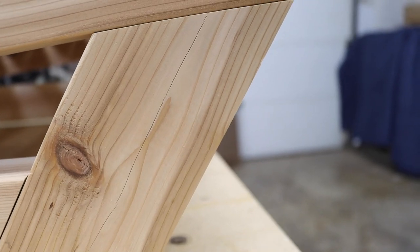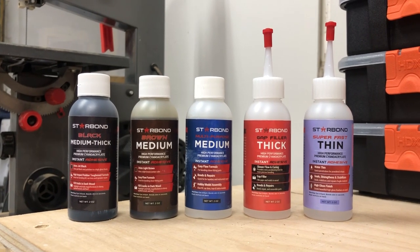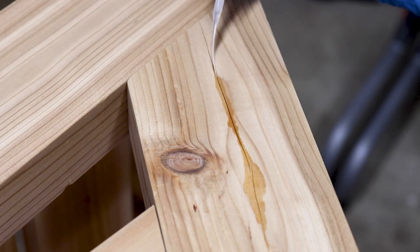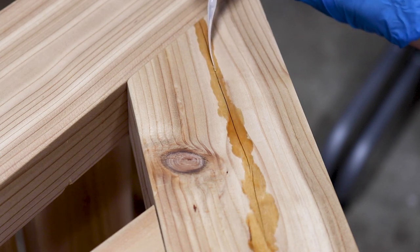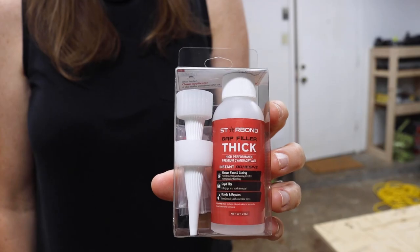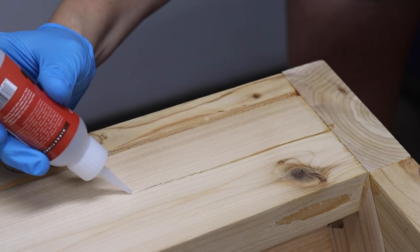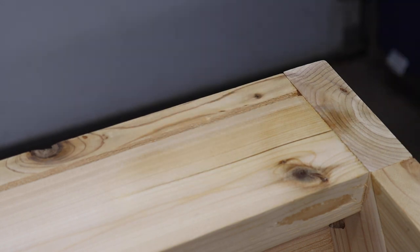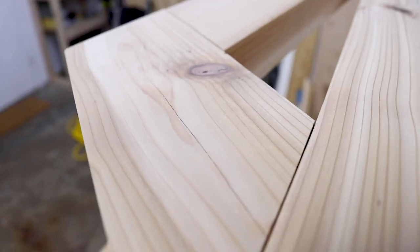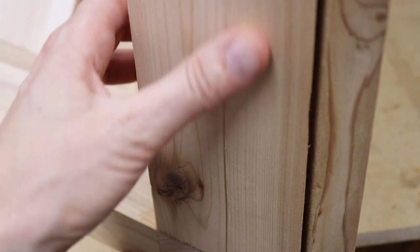There are a couple of small cracks in the wood that I want to stabilize so they don't crack further. I like to use Starbond adhesives for this — for the smaller crack I'm using their super-fast thin adhesive, which is watery thin and great for hairline cracks because of its ability to penetrate narrow spaces. After a couple of coats I hit it with Starbond's accelerator, which instantly cures and dries the glue. The second crack is larger, so for that one I used Starbond's thick gap filler, then hit it with the accelerator and sanded both fills to a smooth finish. It's hard to tell on camera because the glue is crystal clear, but it has filled the cracks flush with the surface and it's super strong — these cracks are now stabilized.